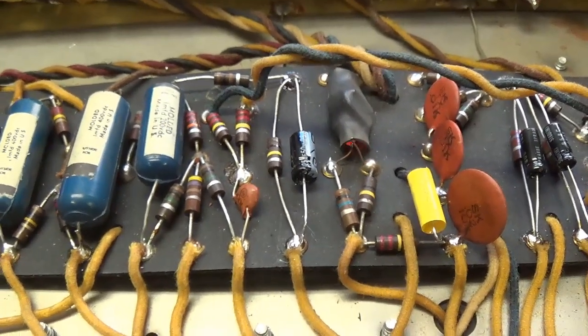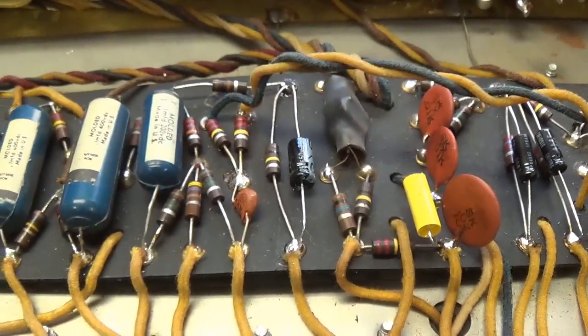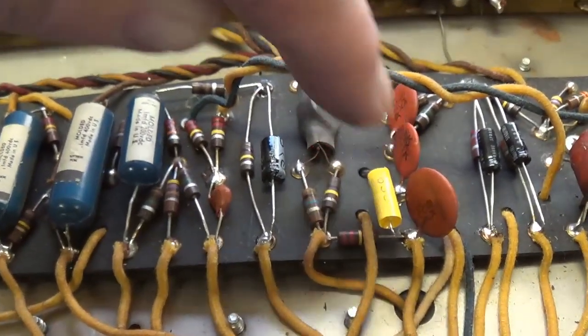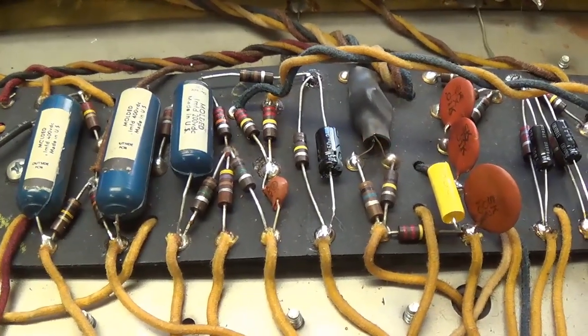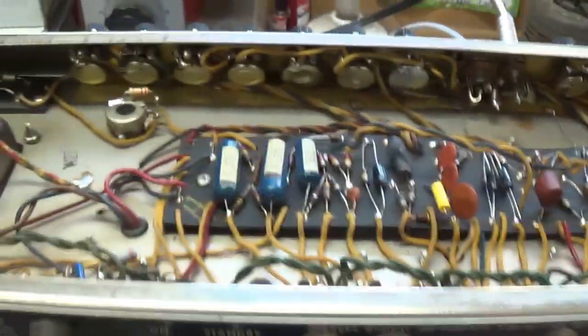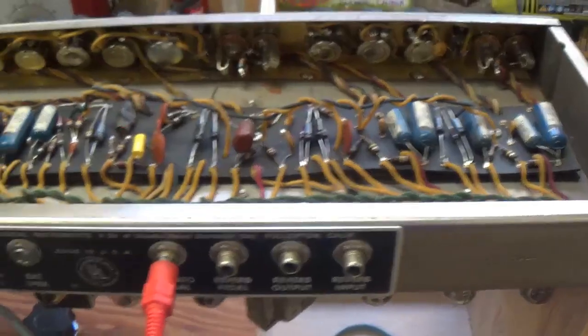I think that's going to work. We'll see in the audio test. If we like it, if it seems slow enough, we'll keep it. Otherwise, I'll go back and put another 0.01 microfarad cap across the middle oscillation loop cap, and we'll slow it down even more. Okay, I think we've done everything we need to do the way it stands. So let's flip this over, get Ollie and Jack out, get the guitars tuned up, and see how this Jewel sounds.